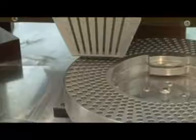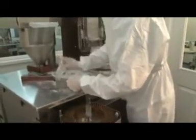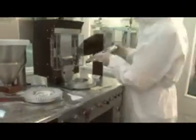First of all, one ring is placed on the right-hand side, which is the capsule filling side of the table. This ring is then filled with empty capsules. A vacuum system splits each half of the capsule into the top and bottom half of the ring. The top half of the ring will then be removed and the bottom half is placed in the filling position on the left.